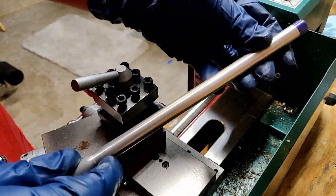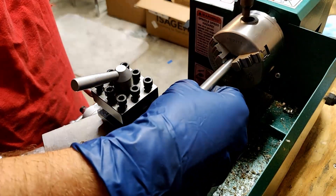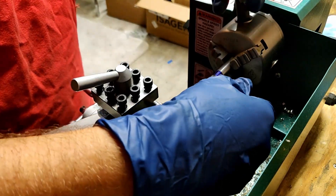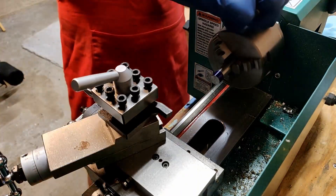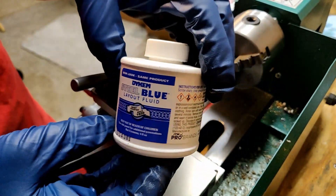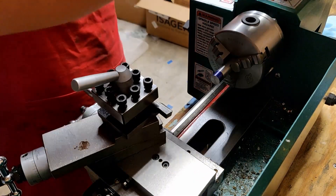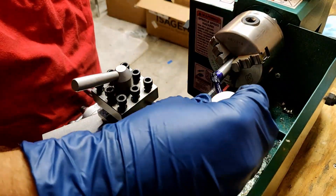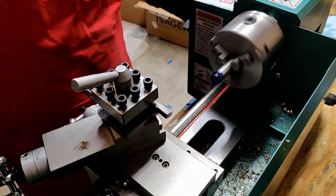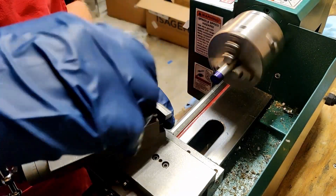Just for demonstration I'll be using this piece of aluminum round bar to talk about some of the things I'm learning about how to use this lathe more properly. I'll tighten this piece of aluminum up in the chuck making sure the tension on the jaws is the proper amount. I've got some blue dykem that will mark the face of the aluminum so we can see when cuts are being made more clearly. It does require some time to dry so I spin the chuck up at low speed to help with airflow to speed up that process.